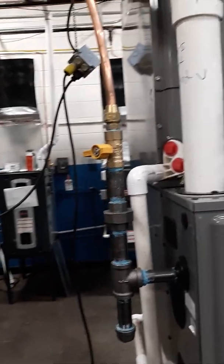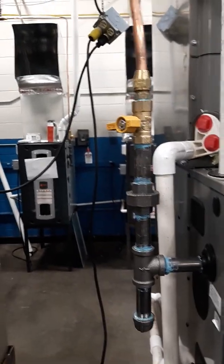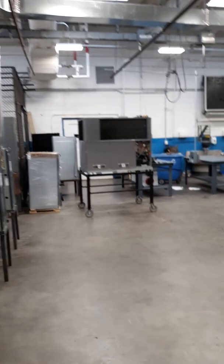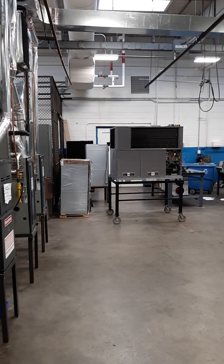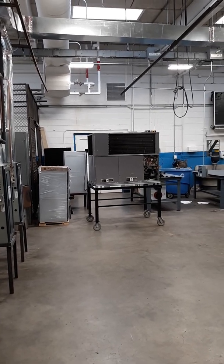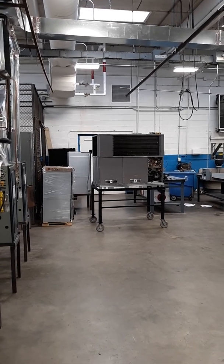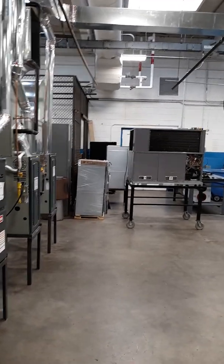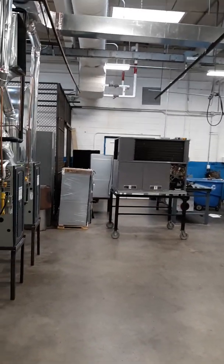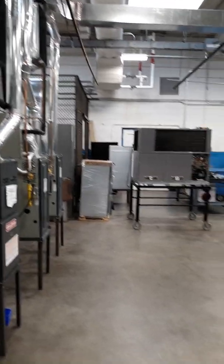The unit I'm about to work on does not have a union. It's standalone by itself, it's on its own wheels. It doesn't have a gas line hooked up to it, so bear with me. I'm gonna take you from the point where you've already disconnected the gas line, and we're gonna pull out the manifold. I'll show you how to clean the burners and the flame sensor — just a short video while we're all at home with this virus situation.